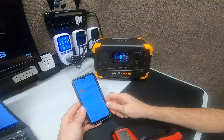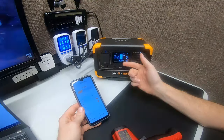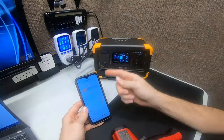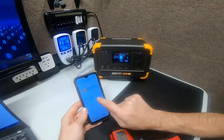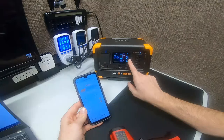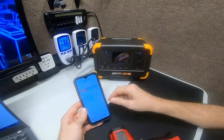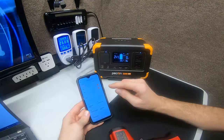The bottom display can switch between modes — easy to forget it's on voltage and wonder why you're reading 20.9 instead of a percentage. On Bluetooth the response is very active and fast — updates nearly instantly. The output occasionally shows 1 watt, which is the inverter's self-consumption, probably below the detection threshold like on the E1500 LFP, which couldn't detect loads under about 6–10 watts.